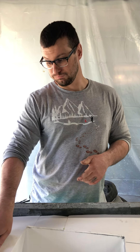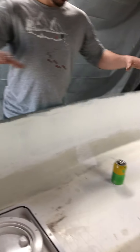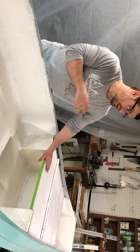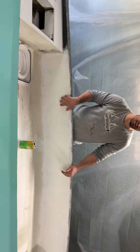What I also have for the stern of the boat is two 30-degree angle rod holders, so if you're cruising along and you need quick access to your rods, you can drop them in and take off. I'm also leaving an access panel up here — when I'm finished, this will be able to fold down, giving you access to more power. It's also been foamed in. The bow nav lights will be wired in here, and the nose cap will kind of hide that in, but you can pull it out if you need to do work.